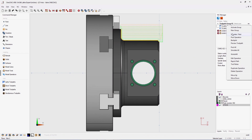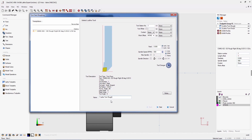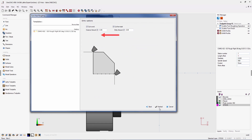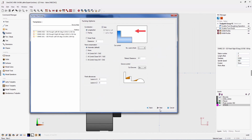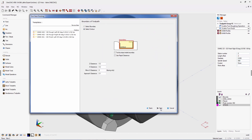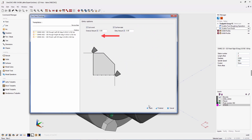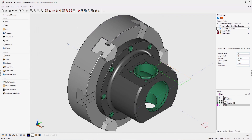Let's quickly take a look at some of the general parameters provided by OneCNC XR8. All machining operations will include the new name parameter, giving you the ability to name the machining operation. Machining operations such as rough, profile, bore, and groove will include the new cut direction control where you can specify the direction of cut right inside the operation. Another very nice addition is the verification arrow within your entry options dialog box — this red arrow verifies the direction of cut before you execute the command.